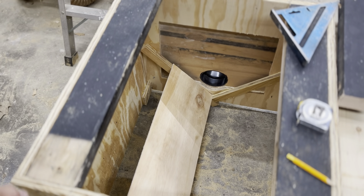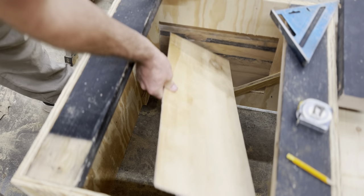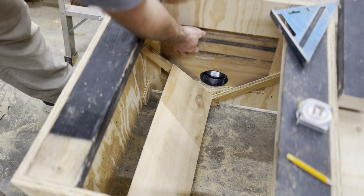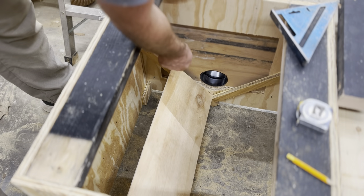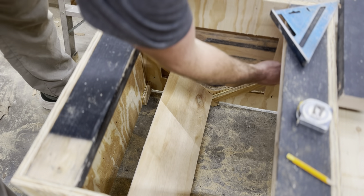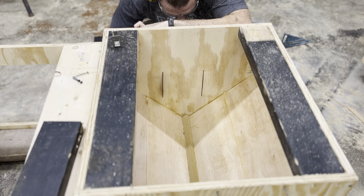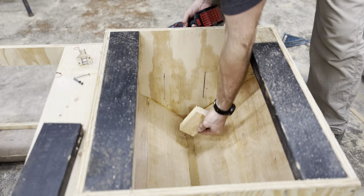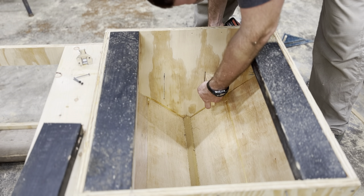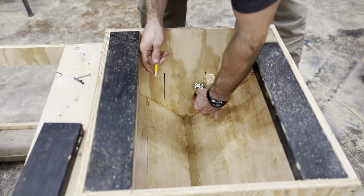This is one of the problems I'm dealing with. It's 22 and a half inches from this side to this side, so of course I cut my piece 22 and a half. I did not take into account the fact that this removable plate is offset by three-quarters of an inch, so now I've got a three-quarter inch gap running up both sides. I ended up fixing that gap by just gluing in some scrap pieces of plywood, cut into little triangles so that they would fit, and I glued them onto the removable door and nailed them in.